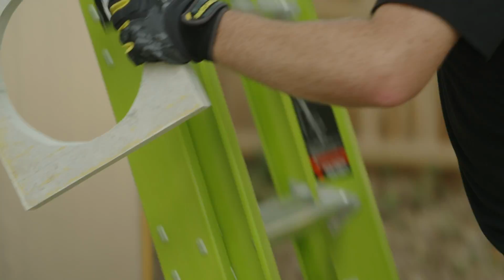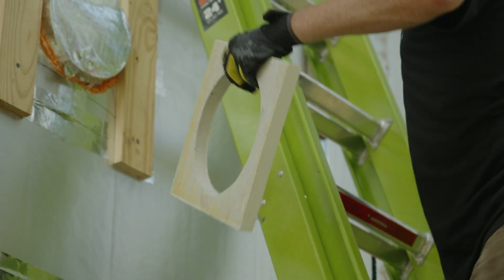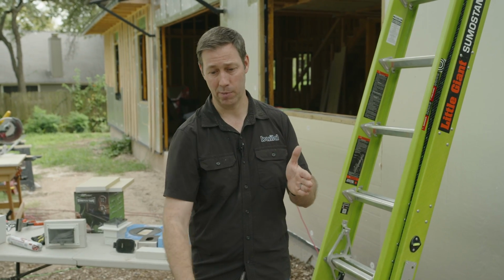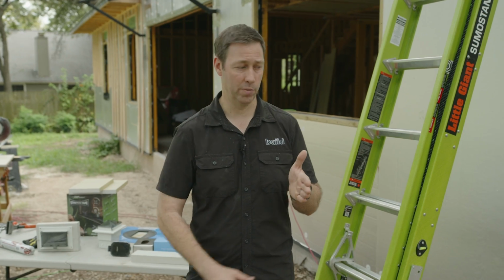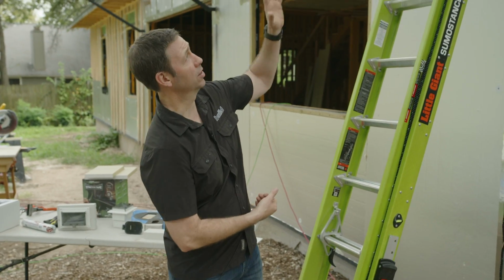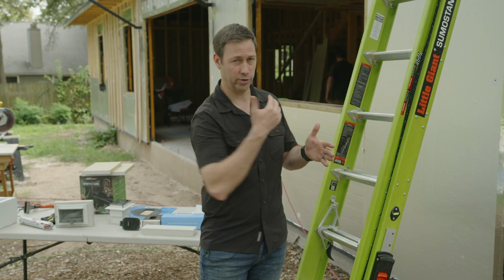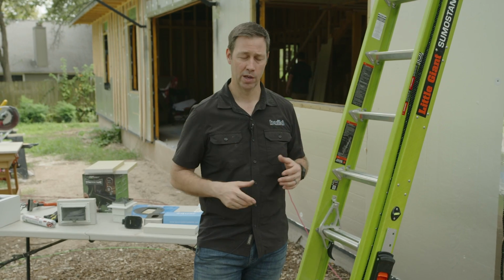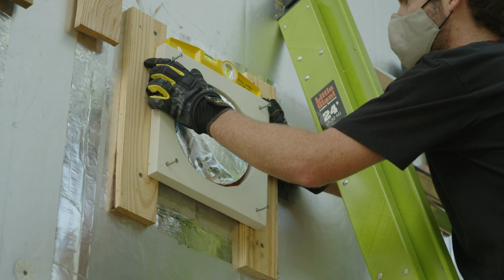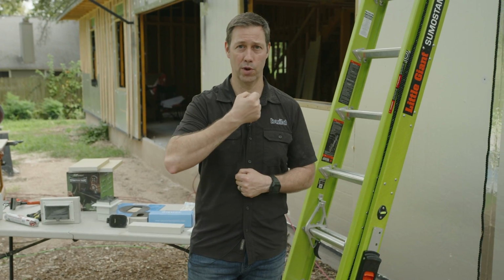Now, when I put my James Hardie siding on top of that batten, I've got that 3/4 inch air gap, which means that if any water gets past my James Hardie, it's going to fall harmlessly down that air gap and be able to drain and dry out. I'm going to have at the bottom of my wall a bug screen with a place to let air in. And at the top of my wall, I'm also going to have an air gap with a bug screen so air can flow right behind that James Hardie siding. I kind of think of that James Hardie siding as the umbrella for my house, right? It's going to shed most of the water, 99.9% of the water, just like when it's raining, you have an umbrella up.